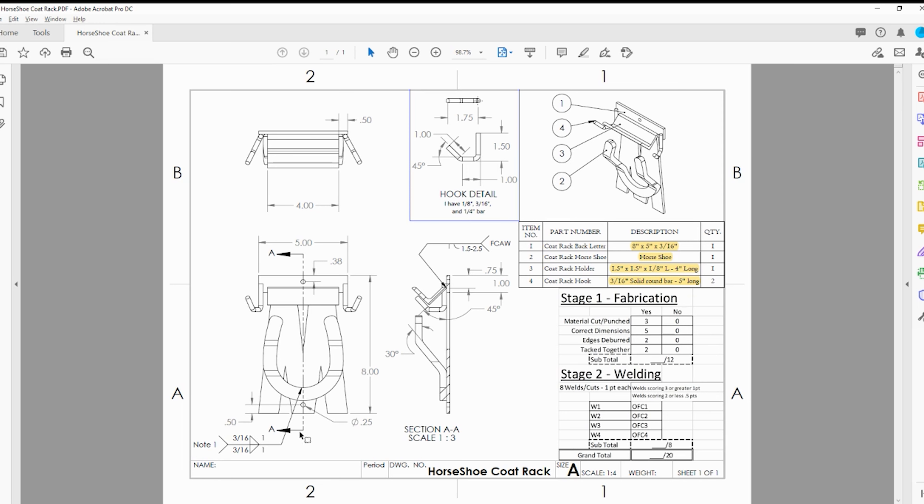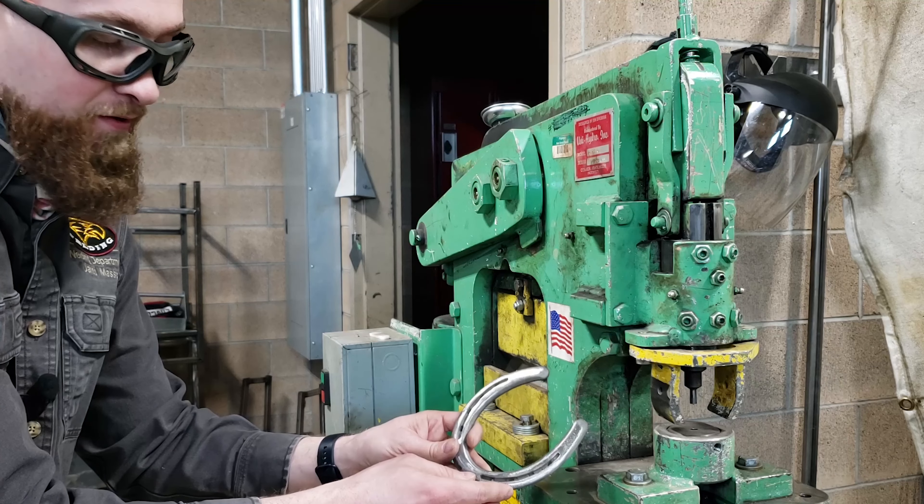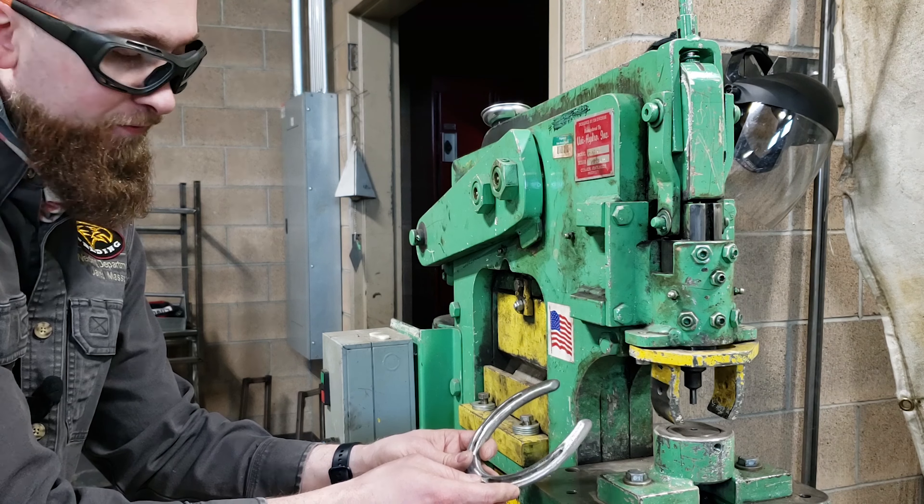On the horseshoe, we're trying to get it to kick so it'll lay flat against something but also bend out and back up. We want the tips of the horseshoe to bend backwards. If I put this in with the horseshoe facing up in the shear, it would bend those out. So I'm going to put this face down - that will allow the tips to point back as it breaks.